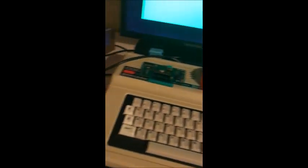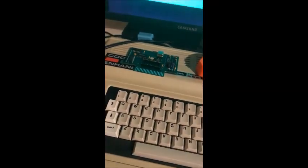And the reason you're going to want a capacitor on there is because when you plug an audio line in, you temporarily short it, and this could potentially wreck something on your computer. Okay, so a cap will protect that.